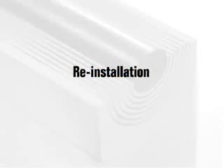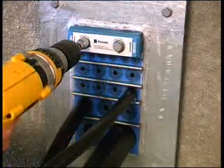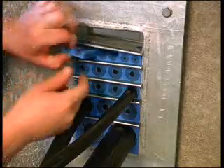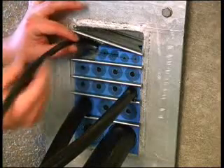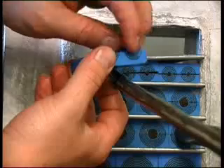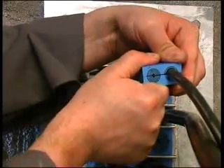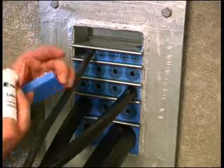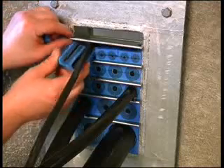Reinstallation. It is easy to add a new cable. Turn the two screws counterclockwise until stop and then remove the wedge. Lift the upper stay plate and take out a spare module and feed the new cable through the frame. Adapt the module to the right cable diameter and make sure that there is a 0.1 to 1 mm gap.